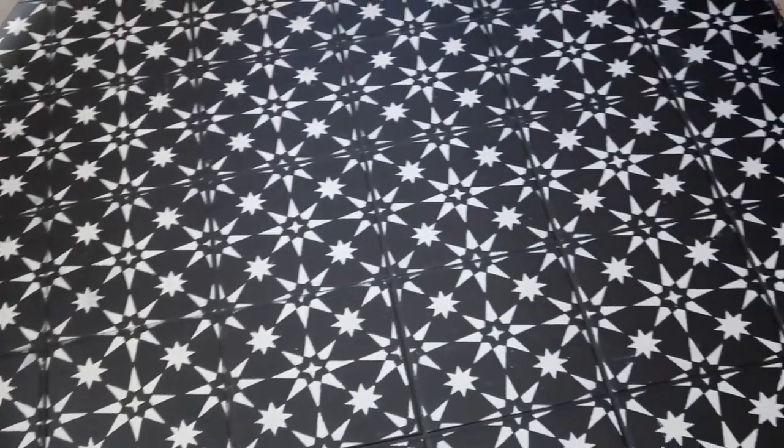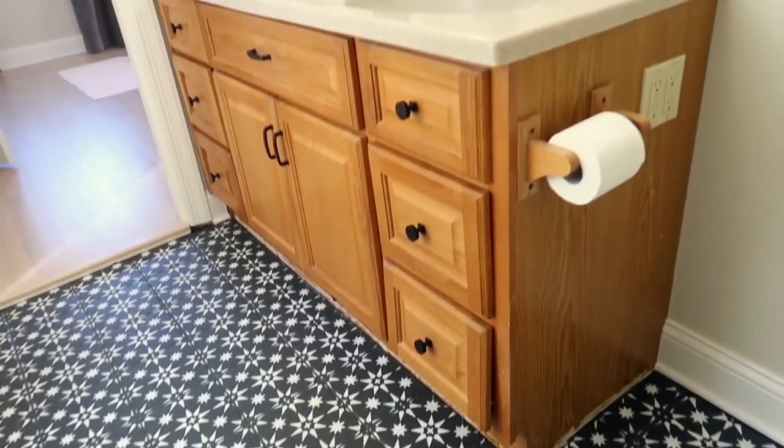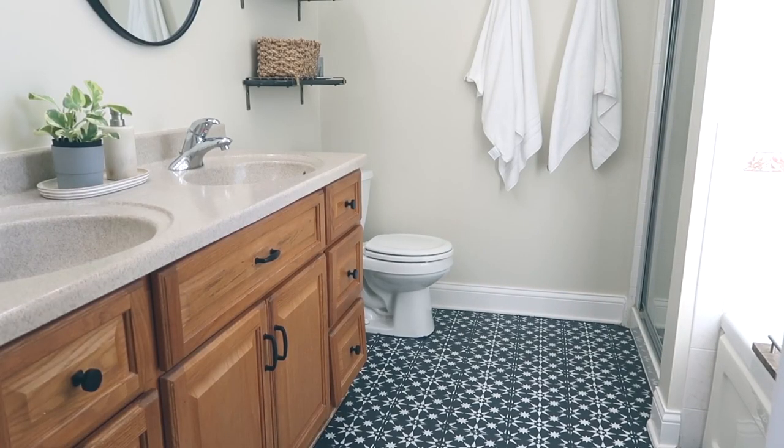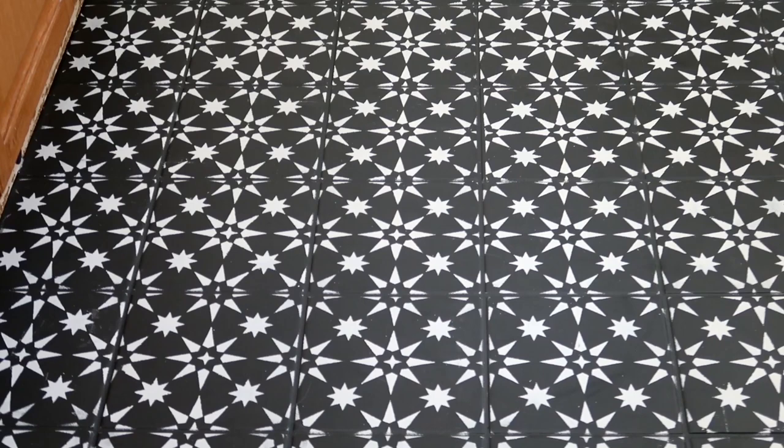It's been 24 hours since I painted that top coat and the floors in here are done. They look incredible. Now I'm going to wait 3 days before putting anything heavy on the ground and 7 days before cleaning it. But the best part is you can use your regular cleaners, just nothing too abrasive. Now, if over time I find that a little area needs touching up, I can paint right over it with that base coat, put the top coat over again, and we're good to go.